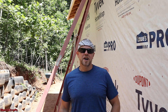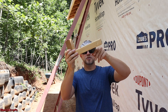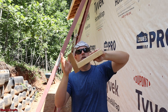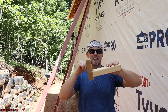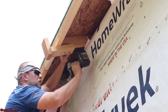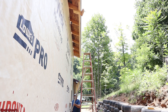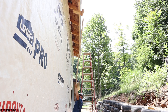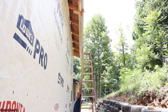Because I'm working alone to put this fascia up, I have created a little jig here to hold one side while I put the other side in. This is simply going to screw into the trusses and it will hold the board up here long enough for me to get one side put on and then I can move down to this side and get that one on. This jig does not have to be in here super tight because I'll be removing it in just a moment. So the jig just has to hold that board in place while I walk up the ladder.